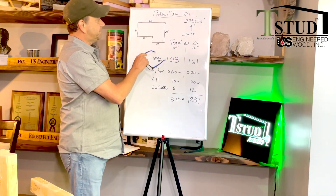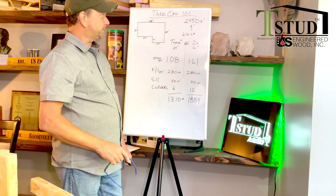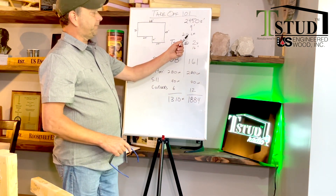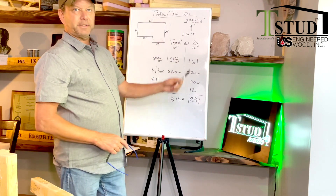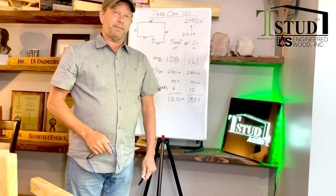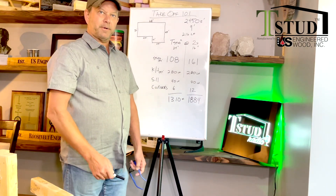So I drew it out. The dimensions are 68 by 44, and all of the outside math adds up. You have 216 lineal feet of wall. It actually came up to 214, but I already did my math at 216 — so what's one extra stud amongst friends?